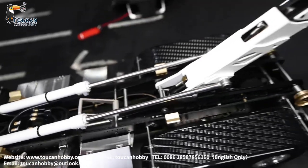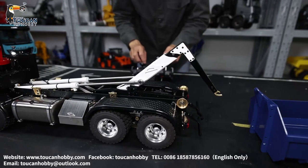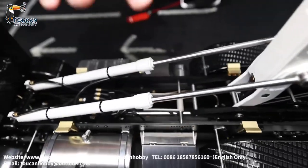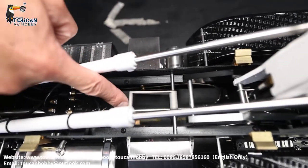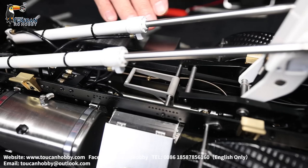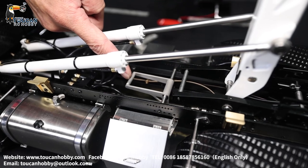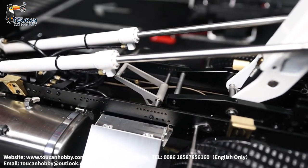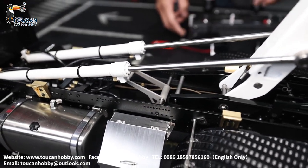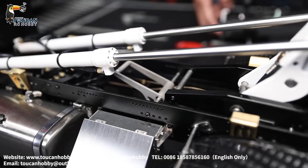When you're raising the bucket up, start the pump and check here. When the bucket is sitting flat on the chassis, you are not able to raise it with the big cylinder because they're already flat. So how to raise the bucket: when you lift up, first this small arm will rise and lift up the bucket, then the big cylinder can push the bucket up more. That's the small arm for lifting up the bucket.